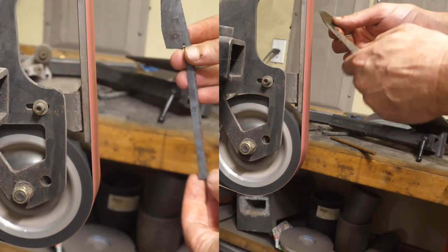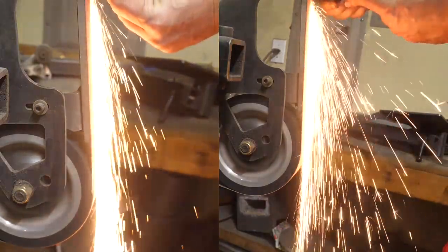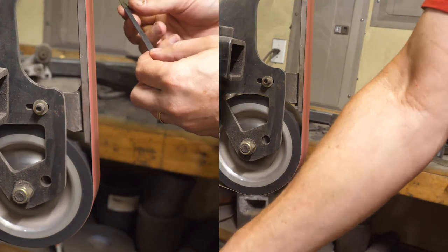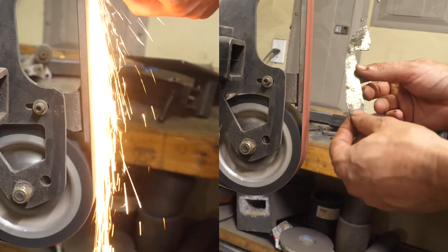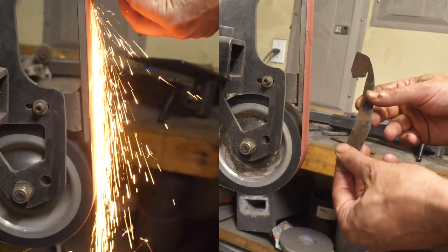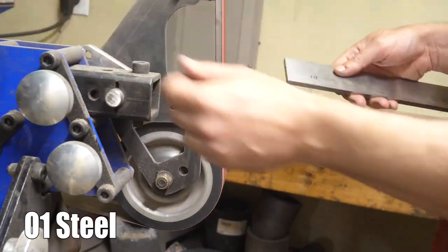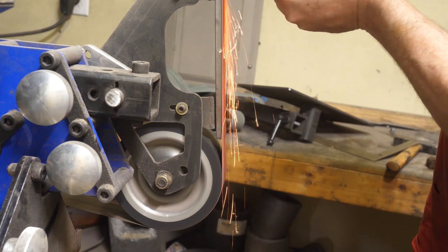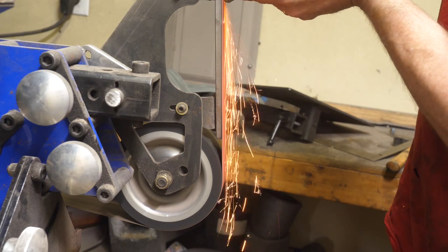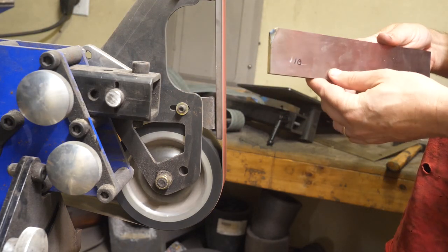So if it's a monosteel, which monosteel is it? These two original knives sparked with moderate to many yellow-orangish sparks that didn't burst much. That color and pattern isn't very consistent with mild steel or even simple high-carbon steel like 1095 or Hitachi white paper steel. To me, it says alloys. Hitachi blue steel is used in Japanese kitchen knives pretty commonly and contains alloys including small amounts of chromium and tungsten. I have O1, which has chromium and tungsten, though a bit less carbon and tungsten than Hitachi blue. The point is it's alloyed and sparks similarly to our two original knives with orange, long, non-bursty sparks. So maybe the steel we're dealing with is something like Hitachi blue — a high-carbon steel that has some alloys in it.